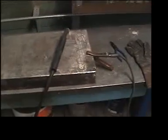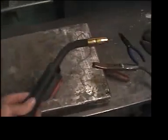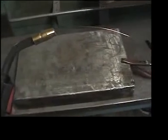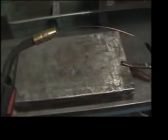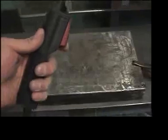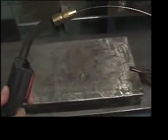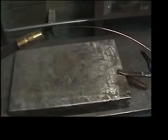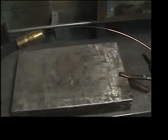Next to that is the welding gun. If I pull the trigger you'll see the wire comes out — that's why they're called wire feed. It comes from inside the welder which has a big spool of wire and feeds it through the torch handle. Every time you pull the trigger this wire feeds out with electrical current and allows the welding to take place.